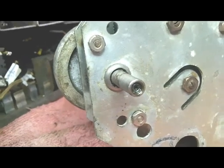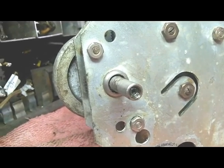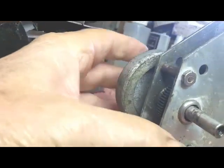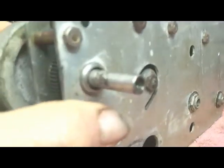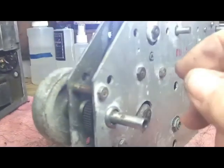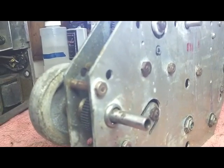The problem was you turn the knob and nothing happens. It turns out this is a clutch-driven mechanism. On the back side here, there's what I call a pressure washer that keeps pressure. You put the knob on the front, and then this flywheel actually screws onto this little shaft, and you can adjust the pressure. That puts pressure between the knob and the outer shaft, and the outer shaft is the one that tunes the condensers. You can see it turning. It's a clutch so you can spin the dial real fast — when it gets to the end, it'll slip.